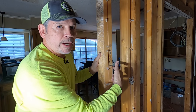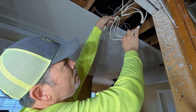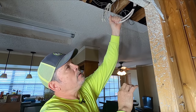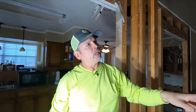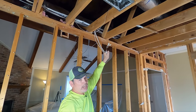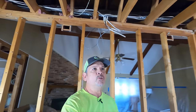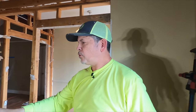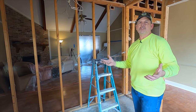So let's head into the dining room and I'll show you what we did in there. We had a dining room light switch right here on circuit 14A, a 15-amp circuit. I disconnected all of that and made up the circuit up here because it feeds another part of the house — that's our lighting circuit for the dining room. Over here, these two are the receptacles for the living room on circuit 12B. And then circuit 11B, a 20-amp circuit, was for a receptacle over here in the dining room. Once we had all the sheet rock down, it was easy to see the wire routing.